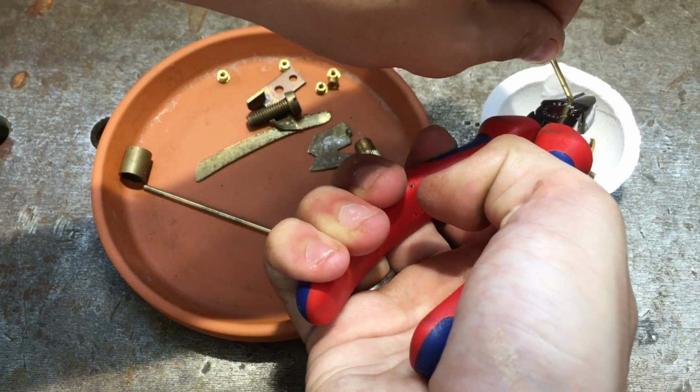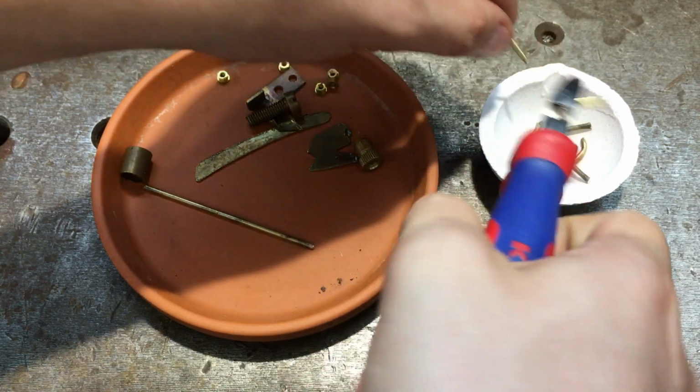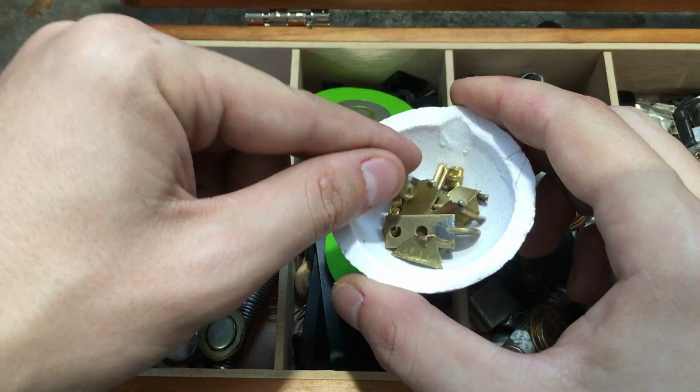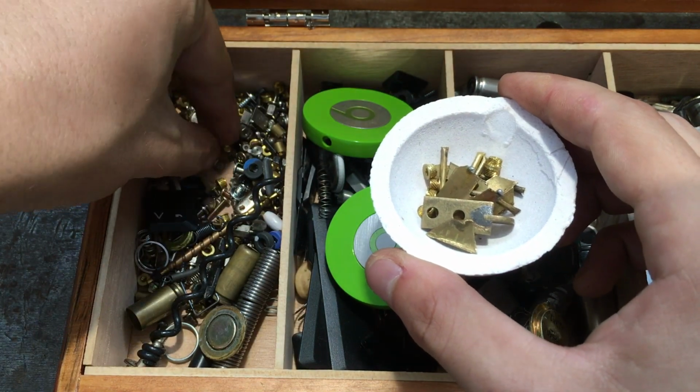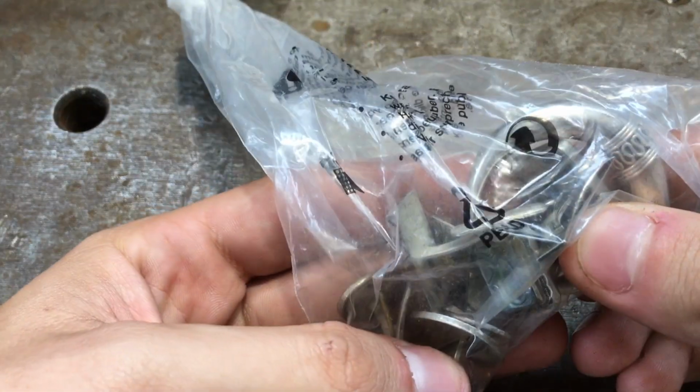Next, I prepared the materials that I was going to use. My plan was to cast both the brass and the silver part into little metal pancakes and then refine the shape afterwards. The brass consisted mostly of scraps and salvaged computer parts, whereas the silver came from eBay in form of old jewelry.